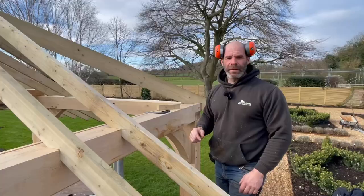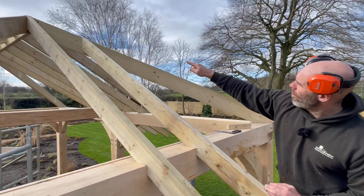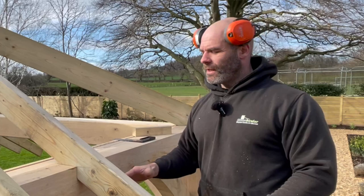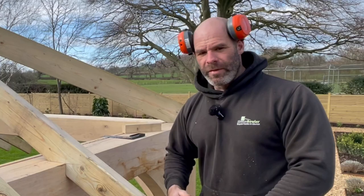Back up on the roof structure now. This one is positioned 400mm off the first common rafter, and you can see that the compound mitre — the top of that — now sits flush with the top of the hip, and the bird's mouth sits nice and tight around the wall plate. That process works for us; it ensures that everything lines up first time, every time. Now it's just a case of repeat, repeat, repeat until we've got all these jack rafters on, and then we can look at cutting the plumb cuts.